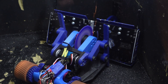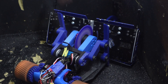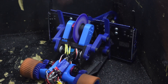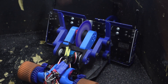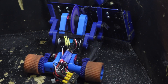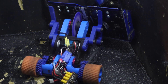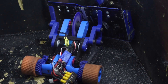You can see a bit of smoke there from something or other, probably the weapon speed controller, but I didn't really notice that while I was testing it and it didn't affect it later. Basically I was trying to see if I could cut through aluminum any better with a thinner blade that doesn't have teeth and instead uses an abrasive diamond grit. This diamond grit is meant for cutting through ceramic tile and steel, so it makes some nice steel sparks and you can see it cutting through alloy steel screws on the bottom of the bot quite effectively, though the aluminum cutting performance remains to be seen.